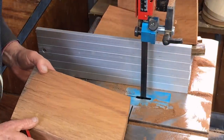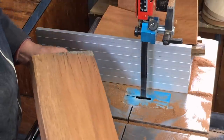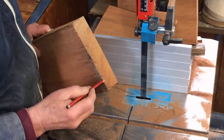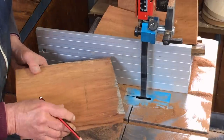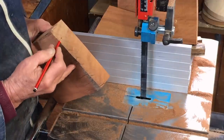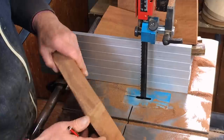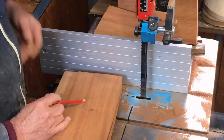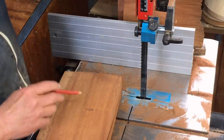Quarter sawn board, that's all nice and clean. And I look on this side, the remnants of the splits down here are coming in as far as this. I can see the very ends are down around there. Now they go in up to about that point, so I might be able to accommodate those in the bottom of a dish. But I've got nice clean material up this side, so that will get a circle on it.